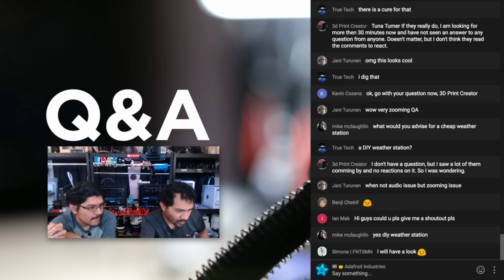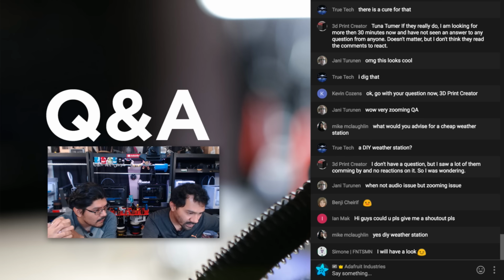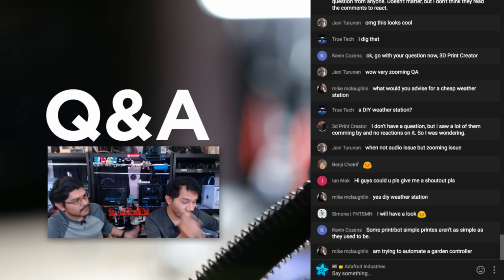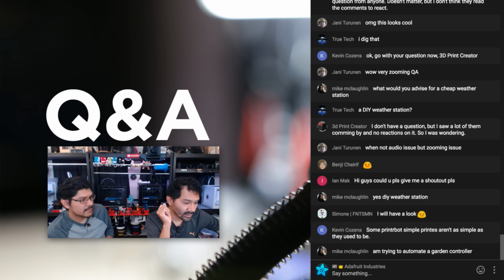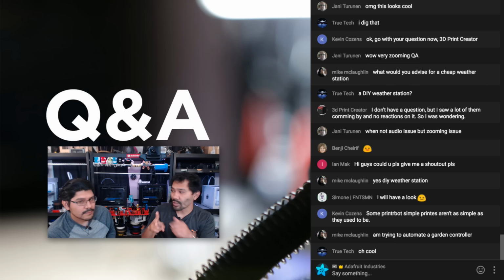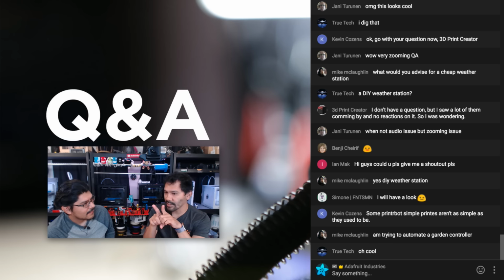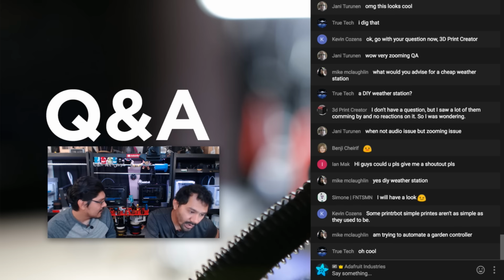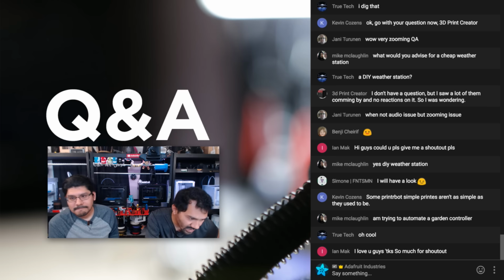Kirby's mentioning that he's gone through 3 rolls of the 3mm conductive filament on his TAZ with no issues. He's saying maybe direct drive is better for it not to grind. So I have noticed. Bowden though. Oh, he's saying direct drive. Okay, yeah, you're saying for the Bowden it's probably bad. I don't have a 3mm direct drive to test that anymore, but maybe you're right. I did notice that when I would go to cut it, to do that 45-degree cut to feed it in, there were air gaps in it, and when I would cut it, it would split apart down the middle. So maybe I just got a bad batch, because we only had one roll of it too. Maybe it dried out or something.